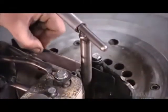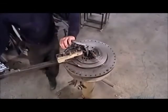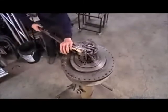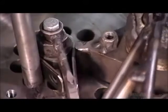Next come the clamps, 7.5 centimeter long steel pieces with a hole on each end. They fasten certain non-welded parts of the sulky together. Each clamp starts off straight. A worker mounts it on the machine called the bender, then pulls a lever almost 360 degrees to curve it.